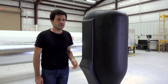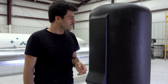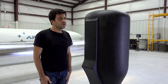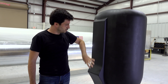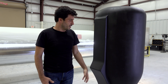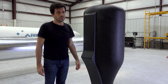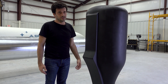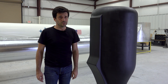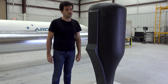On the interior of the engine, because of the decomposition of hydrogen peroxide at 70%, we are going to have 250 degrees Celsius. All we have to do for next week is to add the two nozzles on each side of the engine and we are going to complete the Demonstrator 3 aerospike engine — that is going to become the world's first linear aerospike flight-ready engine. This engine is going to be launched in space in August 2017 from Spaceport America. Let's go.